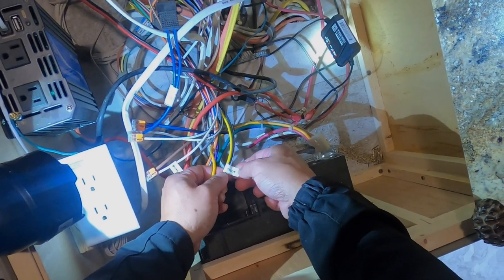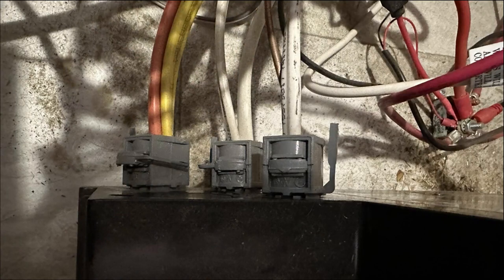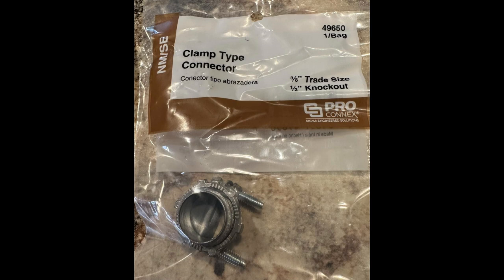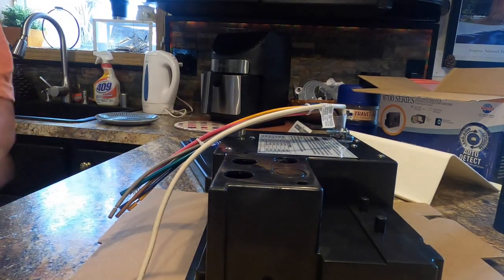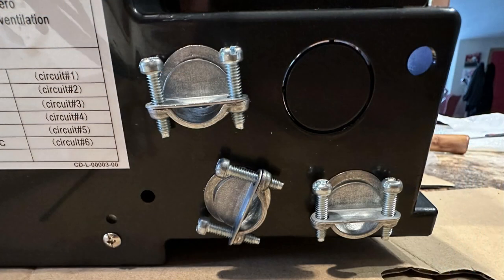It's going to be critical to reconnect all of these wires correctly. The old power center had the 110-volt wires entering through three of four available openings in the back, secured by gray clamps. The new power center did not supply any clamps, so I bought a few at the hardware store that are easier to work with and allow the wire to move back and forth before securing it down. I punched out three access holes in the back of the new power center and secured the clamps in positions that will allow me to tighten them down once the wires are connected to the breakers.